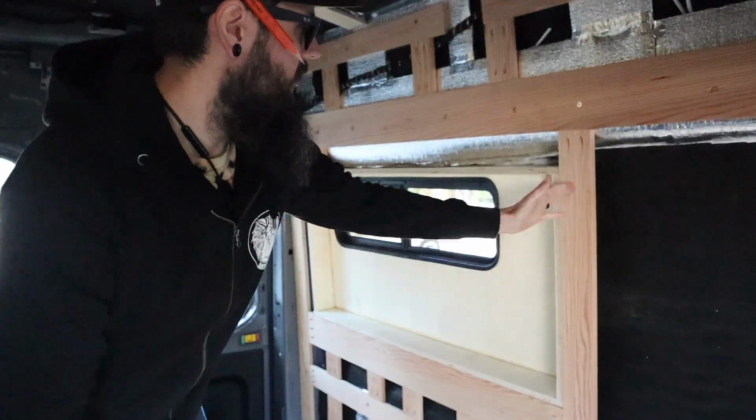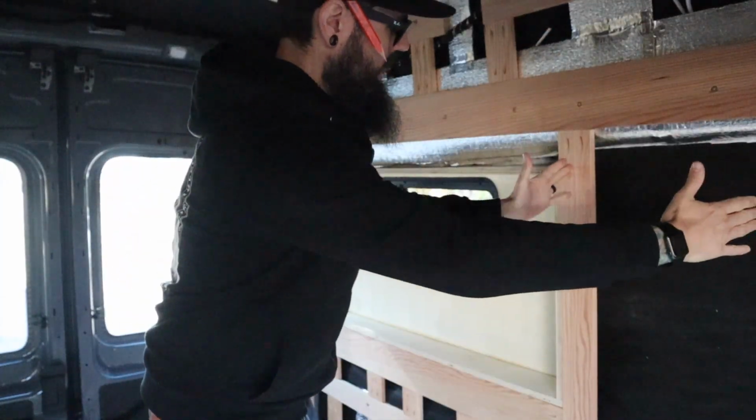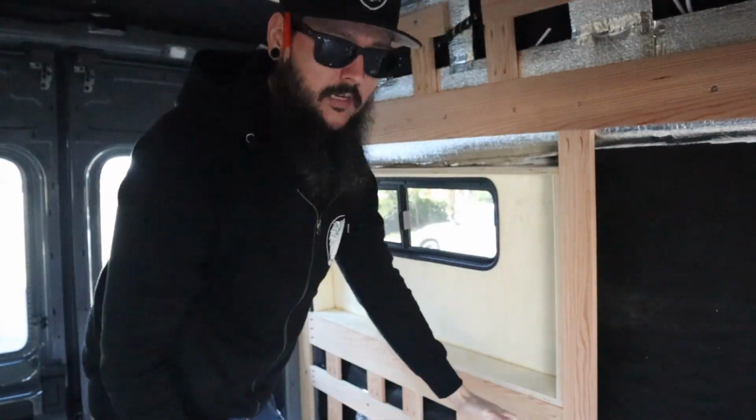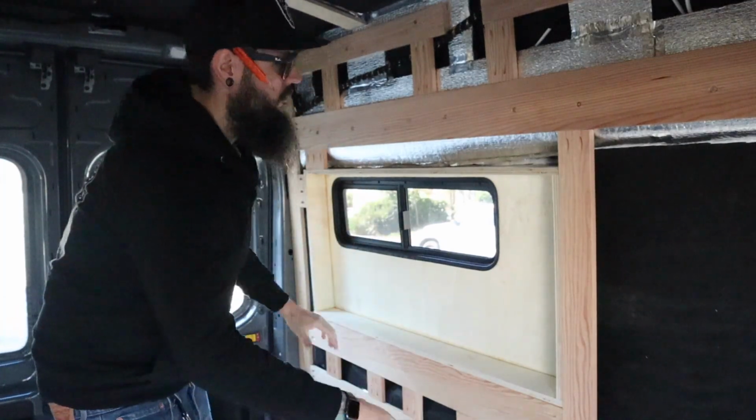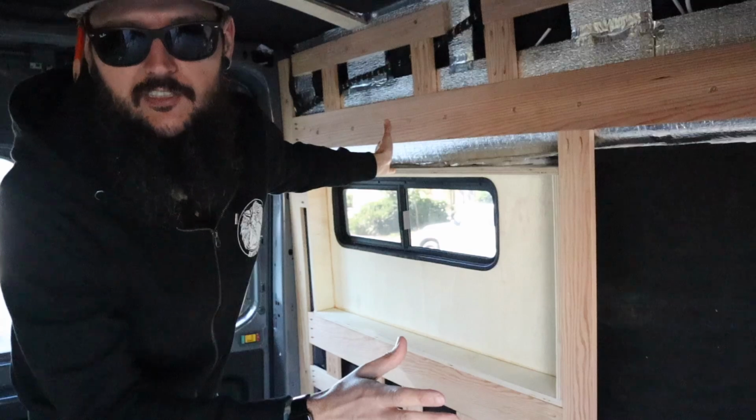Since we're going to do paneling instead of tongue and groove or something like that, I want to do my best to hide the seams. On my first cut, I'm going to attempt to hide the seams behind what will be the closet. The first seam comes out to here, and then runs down under the bed, so that from the cab, it'll look like one big solid piece.